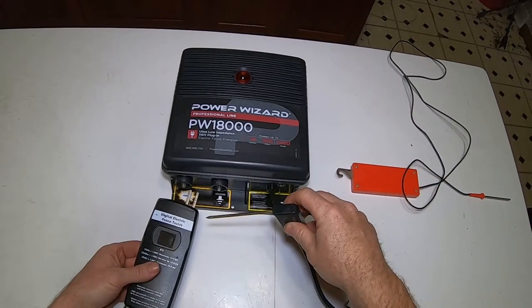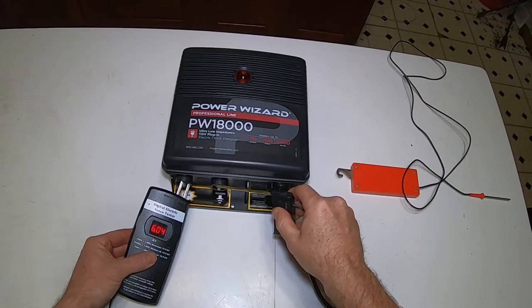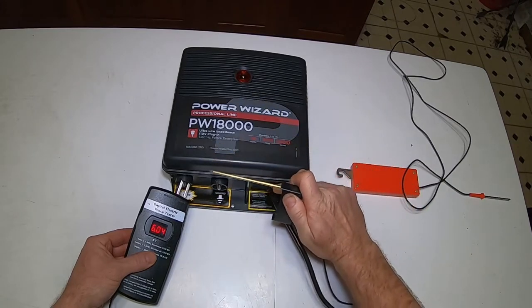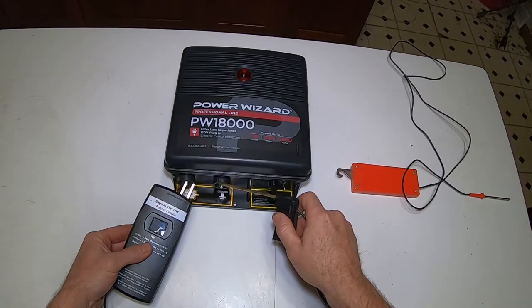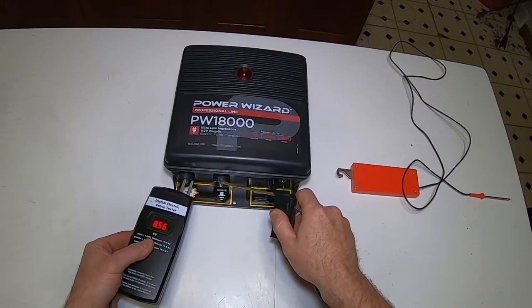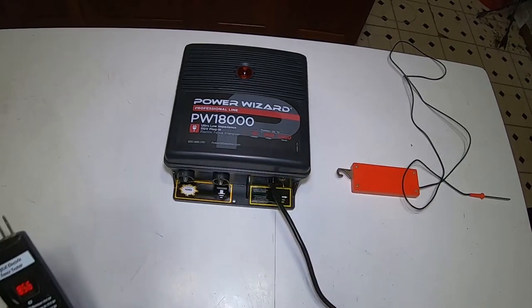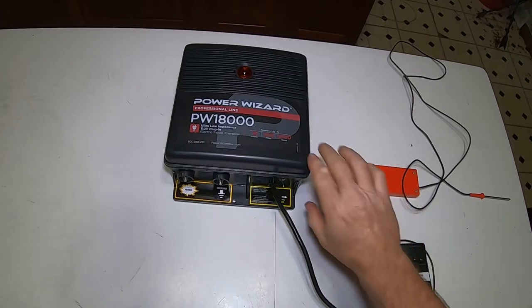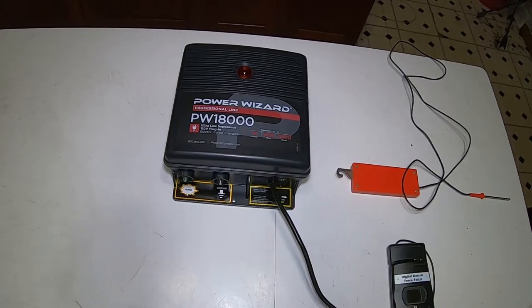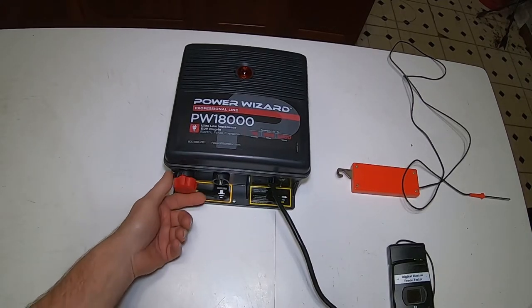Let's go back to low and check the digital meter. On low setting the digital meter is reading a little bit over 6,000 volts for half power. Now on full power — almost 9,000 volts. This should give us plenty. Our current fence charger is only producing about 3,000 volts, so there might be a capacitor or something wrong with it. It's time to replace it — I don't know how long it's been on the farm since it was here before we arrived, so who knows how old that unit is.